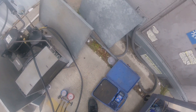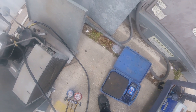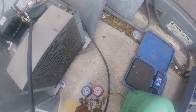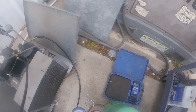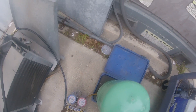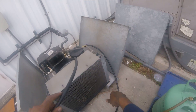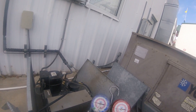Put that on there. I like to turn mine over before I open it up — turn it about four times: two, three, four. I usually do four and then hit it back halfway and purge. I hit a little bit right here as a liquid — my bad. I hit a little bit just as liquid and shut it off. It's not going to take much, then I charge the rest with gas. The small coil is not going to hold but maybe a pound or two, or a couple of ounces.